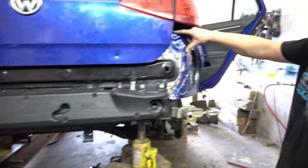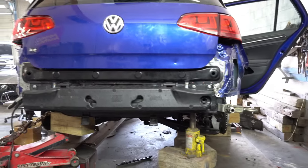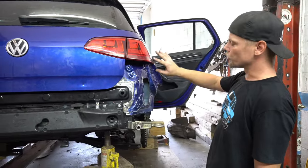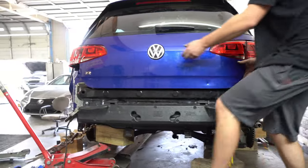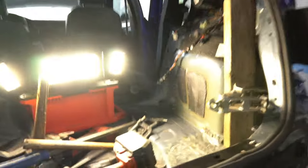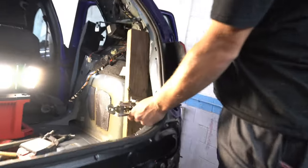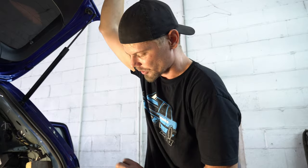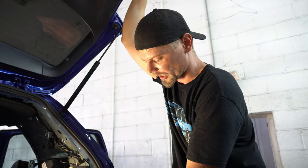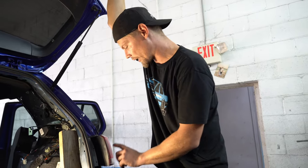I pushed this out from the inside — I may or may not have ruined a clip hole. All that's left right now is to line this tail light up, straighten out this corner a little bit more, and that's it. I've already started welding and everything looks really good — everything's lined up, we've got the seal on it, the floorboard straightened out. I think I need to pull the actual skin right here because it's a double wall. By pushing it, it's just pushing the inner part instead of the whole thing. I can't really grab it because it's just a piece of skin with no flange, so we need to figure out a way to get that pulled out.